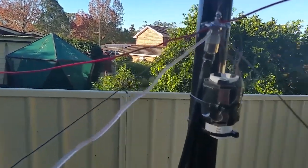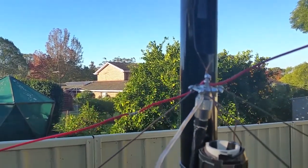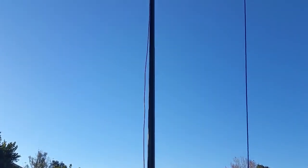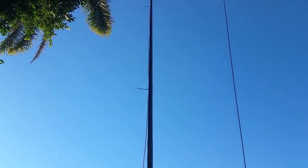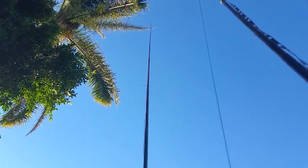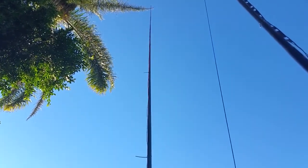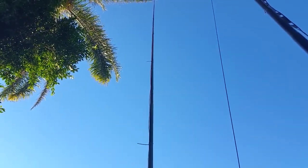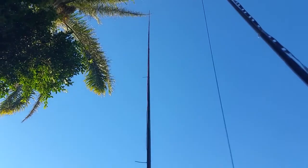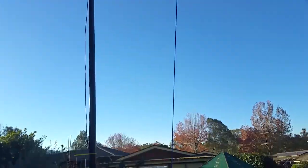Because the 30 metre wire would have added a bit of weight, instead of trying to hang that wire as well, I opted to get a 7.5 metre fibreglass pole and added the quarter wavelength of wire for 30 metres on there. That came to about 7 metres roughly, and I ended up having to go slightly longer to obtain resonance around 10.130 MHz — which is where, almost daily, many more VK amateur radio operators here in Australia are starting to talk. Because the propagation within Australia on 40 metres lately has been pretty crap, unfortunately.